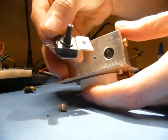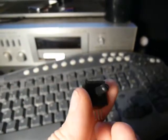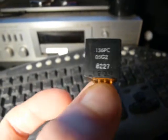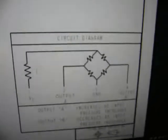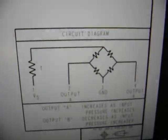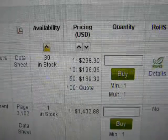It looks like it's a pressure sensor of some description. Here's the device more closely — there's the part number — and apparently it is a 0 to 15 psi pressure sensor from Honeywell, their Micro Switch division. Here's the data sheet. Basically it's just a bridge configuration and the resistance changes. That's the price on Mouser — yikes. You never know what you can find at these ham fest things.